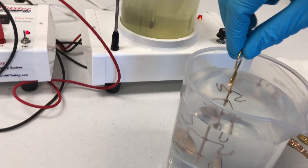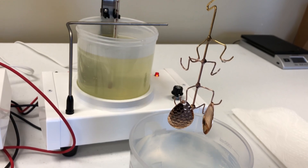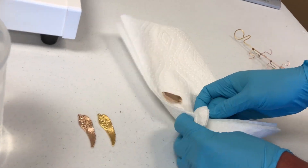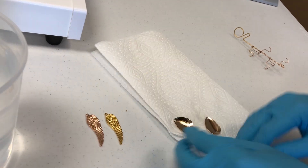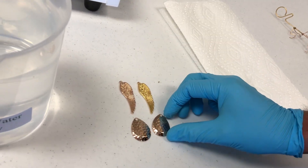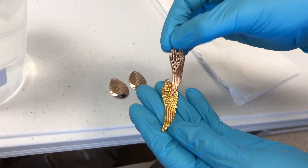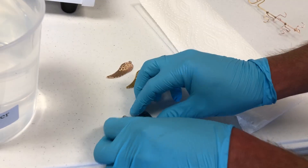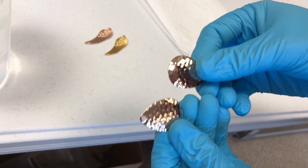It's as easy as that. You could imagine this whole rack being full of four different sets of earrings, and in just a couple of minutes you'd have rose gold plated earrings done. You could also put rhodium in that third or fourth beaker cell, or nickel. Here are some we did before to show contrast — this is the 24k yellow and this is the rose gold. Here are the earrings; they're quite shiny so it's hard to see the color, but they turned out great.